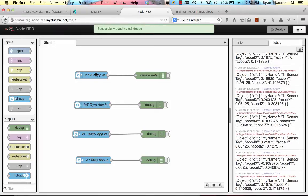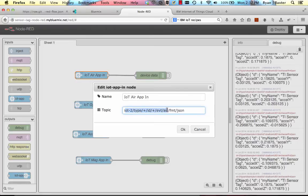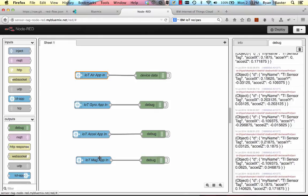One thing I want to point out is that the node application running on the Beaglebone is actually publishing 4 different topics of data. That's what these 4 different nodes correspond to. You can see which topics are being published just by looking here. These are the topics that you can subscribe to from the Node.js application that's publishing data. We have one for air properties like the temperature, the humidity, the pressure, etc., and another one for the gyroscope, the accelerometer, and the magnetometer. If you just want data from one of the specific sensors, or just things related to the air temperature, etc., you can subscribe to only those topics as opposed to subscribing to everything, which is convenient for application developers.